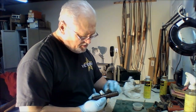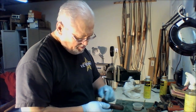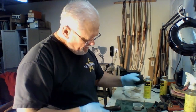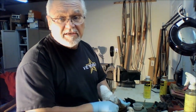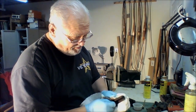Those first two coats cut with mineral spirits will be thinner and will actually get deeper into the wood. But this is the way I like to do it — I guess I'm just hardheaded. I've been doing it this way for years and this is my preferred method.